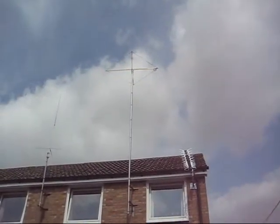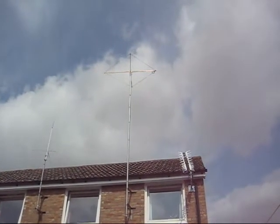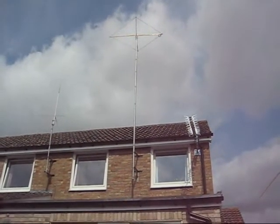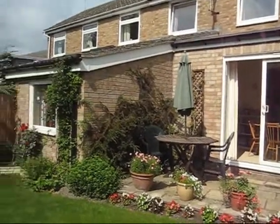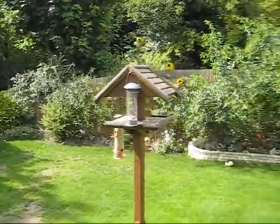And finally the antenna — a 5m long pole with a 28 MHz halo at the top, which forms a top capacity hat. It's on the back of the house, with a ground connection in the corner behind the table and another ground connection at the bottom of the fence with a short wire between.